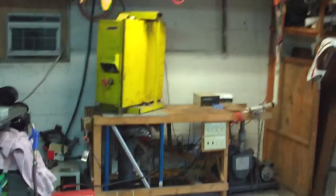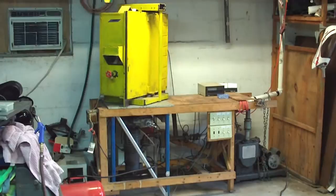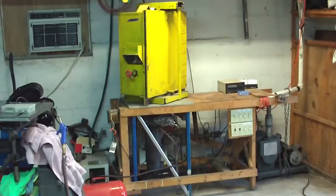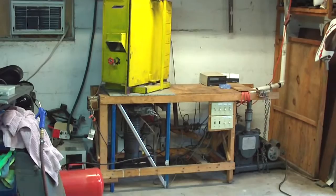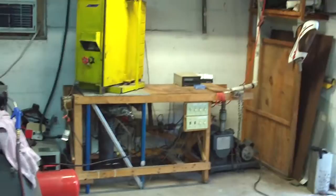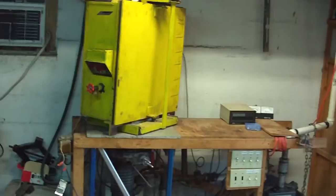It is damn near a perfect — not perfect vacuum, but a very high vacuum. It's not an ultra high vacuum. As a point of discussion for how high the vacuum is: it's made from just mild half-inch-thick steel, and at the vacuum level we're at, we're concerned about the porosity of the steel — hydrogen leaking through the half-inch-thick steel. Over time that will fill the chamber. Your rubber O-rings leak not because there's a crack in them, but because gas is going through the rubber — outgassing, things producing vapor or gas just from sitting in a vacuum. Those things all become concerns. So yeah, it's great fun.